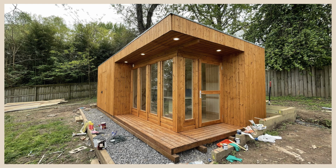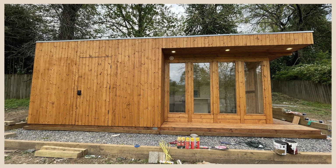It's a yellow family of wood, and because of that, if you put any sort of polyurethane or clear coat stain on this, it's only going to accentuate that yellow and make it even more prominent. And I did not want the building to feel more yellow. If anything, I wanted it to feel more birch, more white, like continue that modern vibe. But long story short, that's where we've come to. I think I like the color that we chose, but I'm excited to see what it looks like faded out. Okay, I'll quickly end by mentioning what we've been working on the inside.